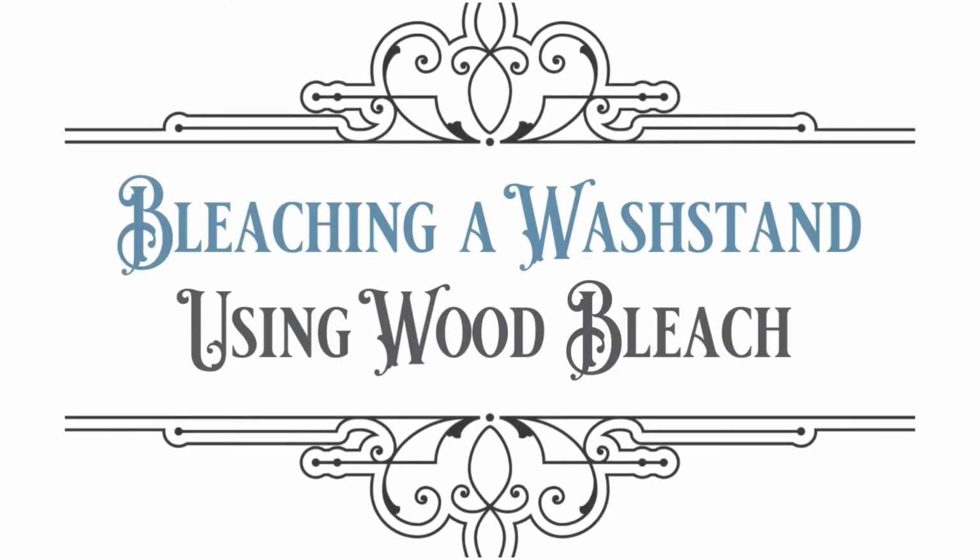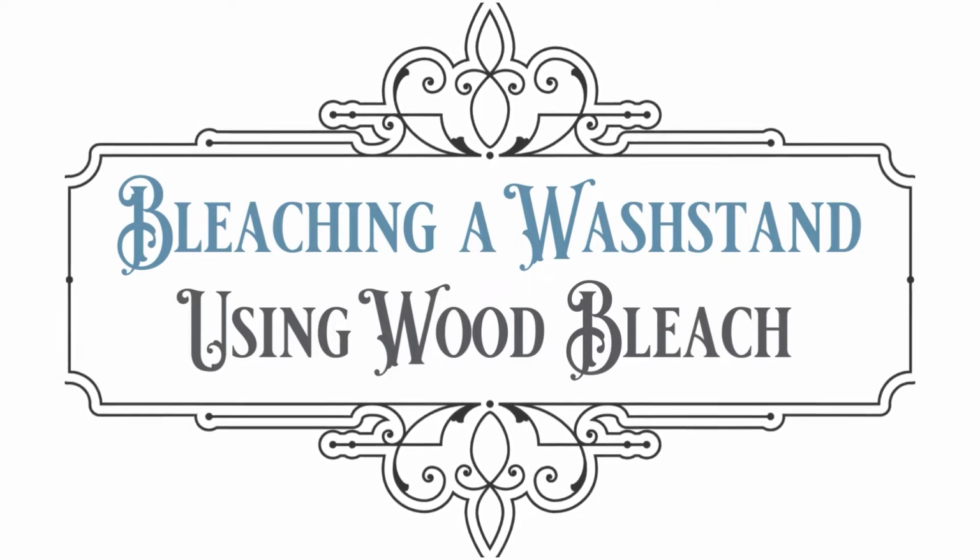After doing extensive research on mahogany and how to neutralize the reddish tone in wood, there were a couple of options. One of them was to add a little bit of green to your stain to neutralize the red using the color wheel, and that seemed a little more trial and error than I really wanted to do. So the second best option was to use a wood bleach that is specifically made for this type of thing.